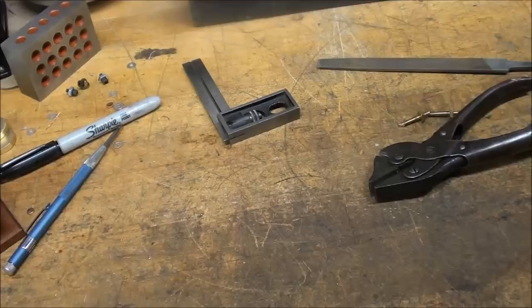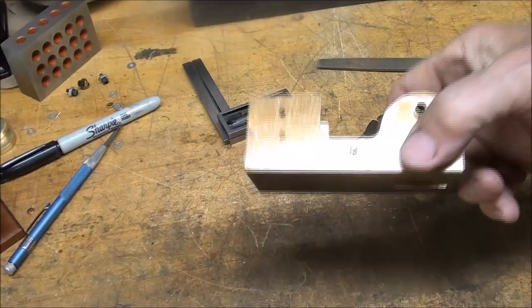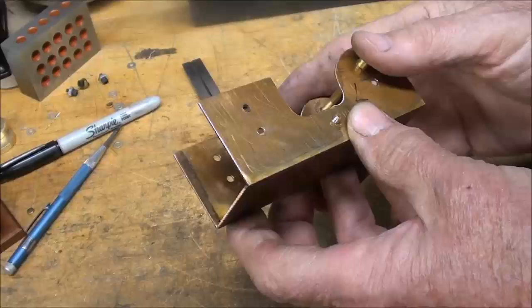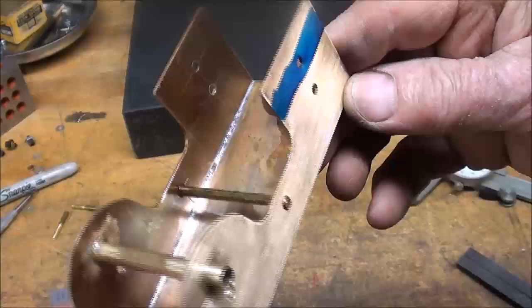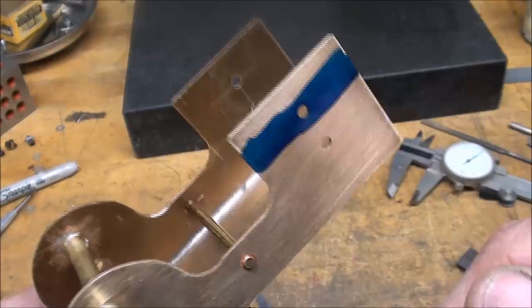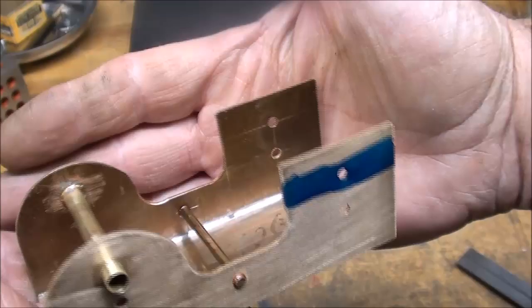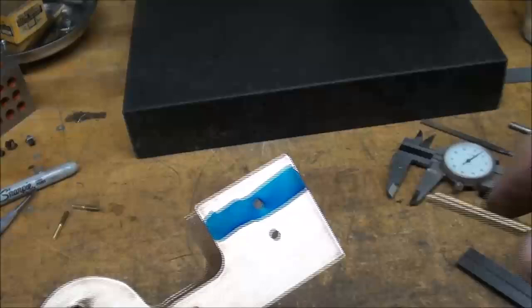So the frame of Yellow Boy 2 is about done, and I'm ready to start on the cylinders. But I'm still going to put some permanent stays in here. Yellow Boy has received a little bit of superficial polishing on the outsides — I don't bother with the insides. I put a stay in there, and being the Loctite fan that I am, I Loctited it in just for a change. I didn't want to introduce heat in there and ruin my little soldering joint. It extends out a little bit — that's just going to be the appearance — and there will be another stay here.